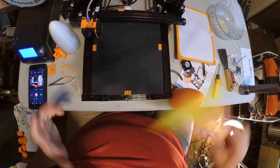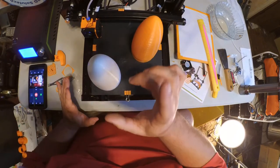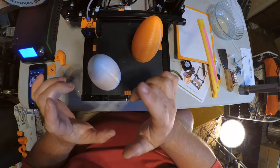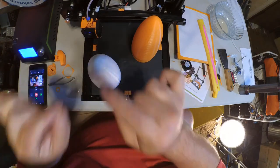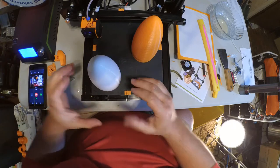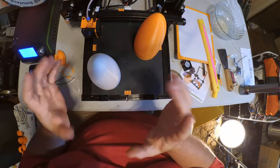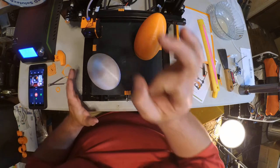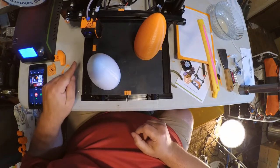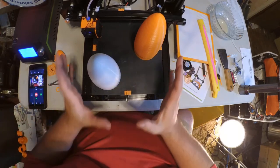Now, I found a neat little trick, the one I was just showing you. If I move the parts far enough away, and I print them in the correct order, I can actually print an entire object, as long as my G code never commands this hardware to move back into this occupied space. But that requires my intelligence and my ability to understand and see and feel and touch and measure, none of which this printer can do and none of which the software can do. Which is why when you do sequential print, it starts off with zero. You have to measure your printer and tell it how much it can go without colliding. And if you give it the wrong measurement, it'll try to do it anyway and it'll collide. That's how sequential prints work.